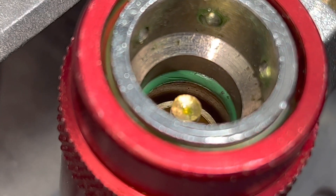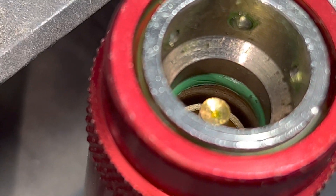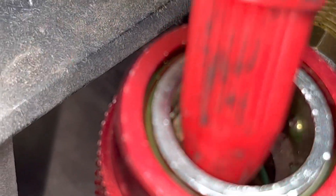But let's say you didn't have another coupling or that o-ring — that will make a vacuum leak. After you pull a vacuum, a little bit of air will start leaking into your system through that tiny scratch in the o-ring. So you get Nylog and you put it around the inner circumference.